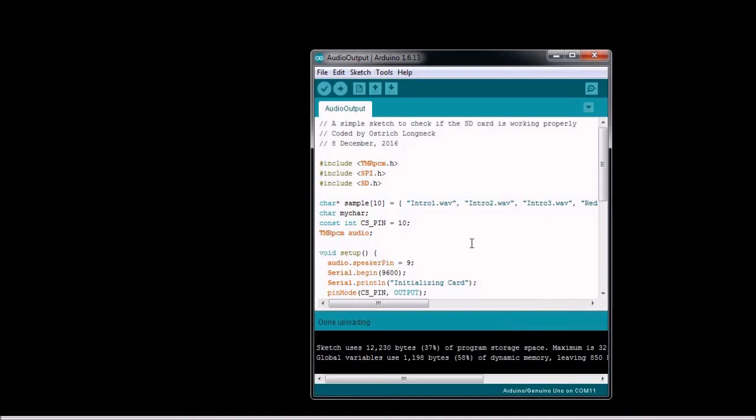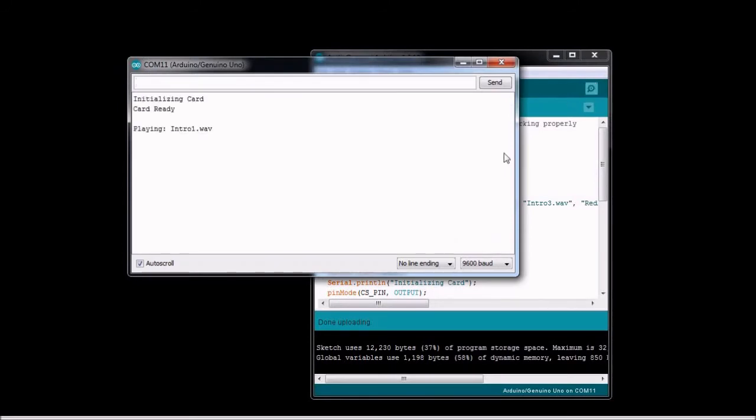This time, however, when the sketch is running we click on the little magnifying glass in the top right corner of the Arduino user interface, which opens the serial monitor screen. The output screen shows us the status of our SD card reader. If it's connected properly we see the card ready message; if not we'll get a card failure message. The sketch will loop through the sound effects, displaying the name of each one as it plays. If we disconnect the Arduino from our consoles and connect it to an external 9V or 12V power supply, we will get a better idea of the final volume and quality of the sound being played.